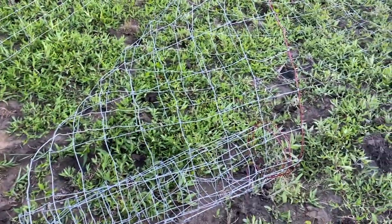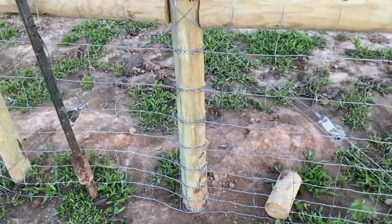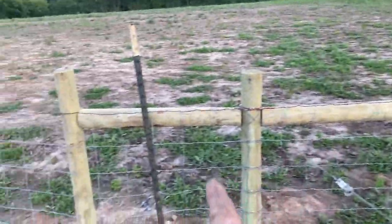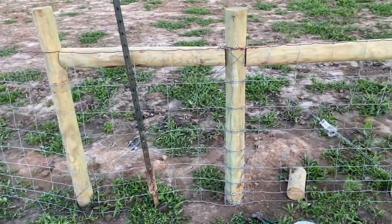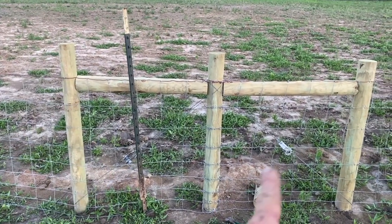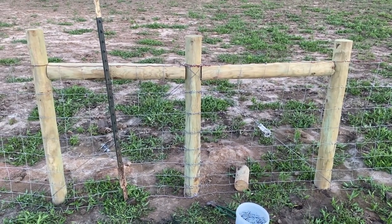This is what we're working on. I went to work today, came back, and picked up where I left off the other day on this. We're putting up a woven wire fence. This fence is 39 inches tall. And some of my work — this is where this row ended, and that row that you can't see right around the end of that pole down there started. I got my poles braced up, and then I got my other wires in there. Depending upon what picture you see on the internet, this might need to be up there or down there. I've done them both ways. And those right there are pretty much to pull the poles tight and keep them from moving.